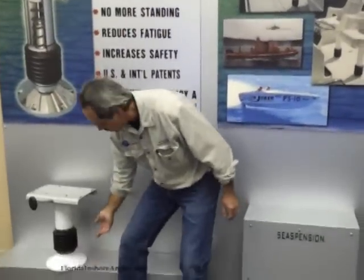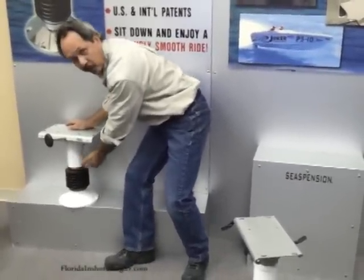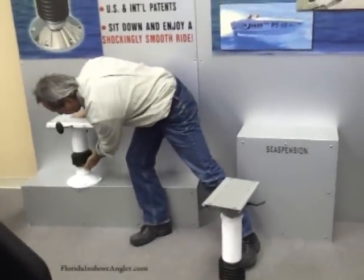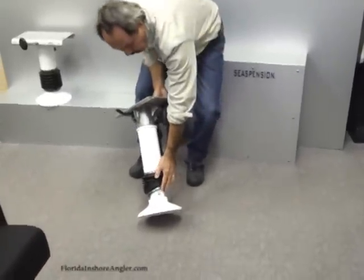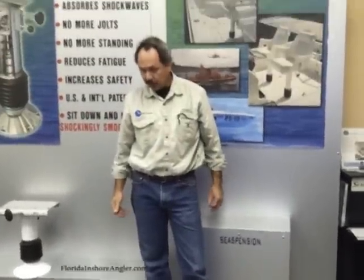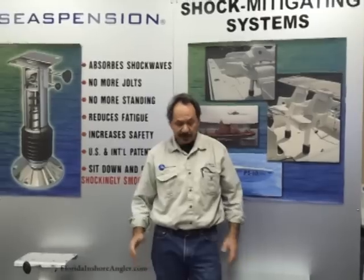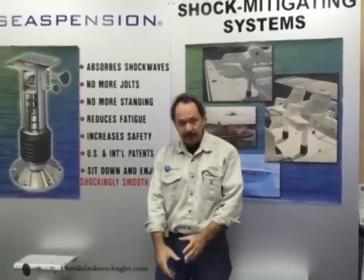It's a double pedestal system. So you have the inner tube in here and a 4-inch outer tube, providing for optimum strength. The base is actually bonded. Let's see it. Well, you might not see it so easily. The base is bonded, urethane bonded, right here. We don't use any welding or swaging, which prevents strength issues, and we rather go with a urethane bonded process that allows a little bit of lateral impact mitigation, and once these things are mated, you'll never get them apart again.